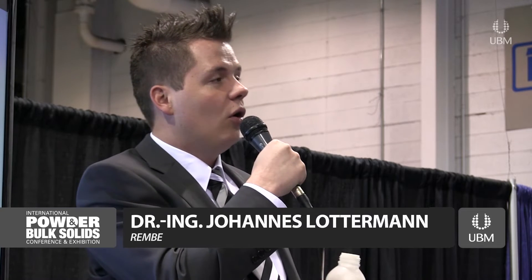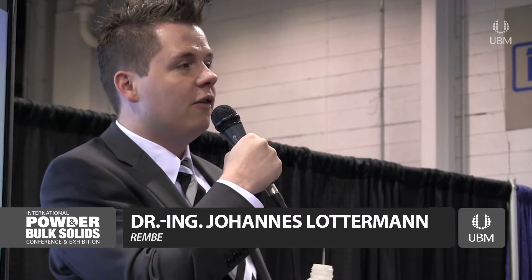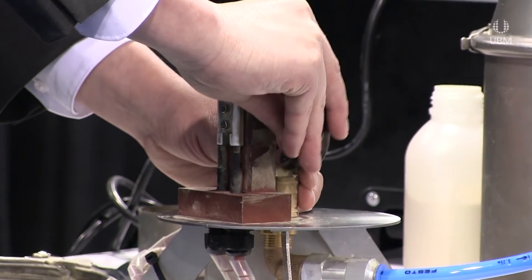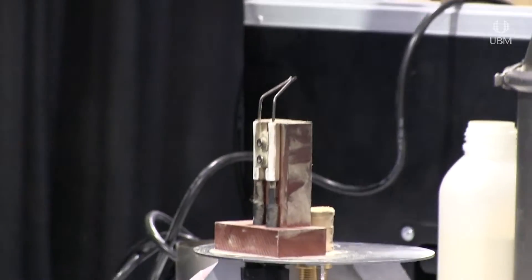Please allow me to do some preparation on the test equipment in order to whirl this dust up, get it airborne, ignite it, and then show you how a dust explosion-prone vessel can be protected by means of explosion venting. This is just a small amount of dust — just enough to create an explosive atmosphere in my test vessel.